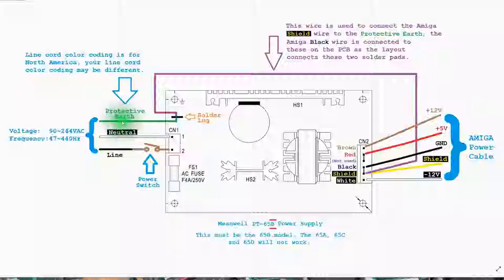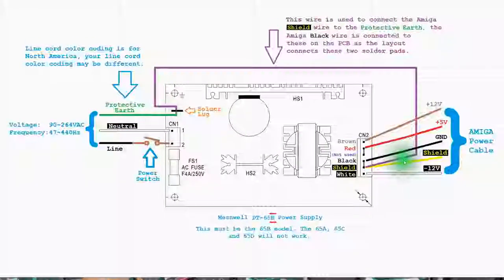In this drawing I've color-coded the wires coming from the line cord: black, white, and green. This is the normal North American color coding — green is protective earth, white is neutral, and black is the hot lead. In my build, the line cord black is connected to one side of the power switch, which has brown wires on it. The other side of the switch goes to the supply pin, neutral comes in here, and the green protective earth lead from the power plug is also hooked to the spade plug. This protective earth gets passed through the purple wire to the shield, cable, and system ground, giving everything a solid reference. I determined these were hooked together by ohming out an actual North American power supply.